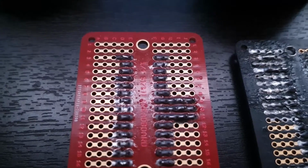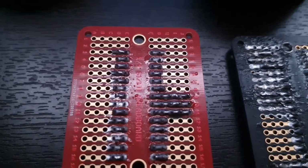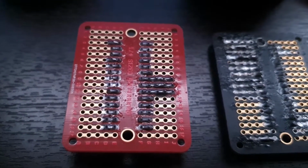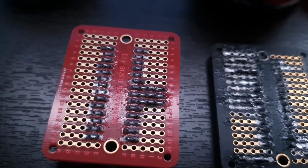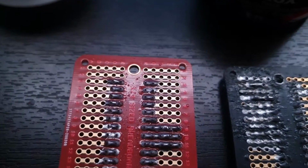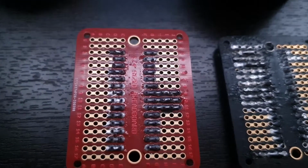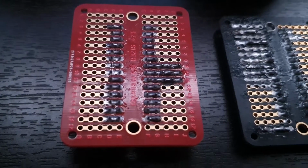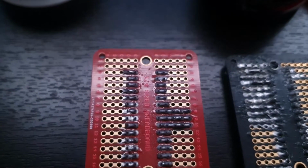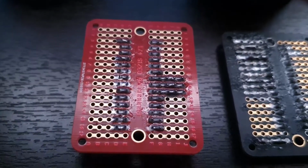And I just take like a screwdriver, you could take like a paintbrush or whatever and just put it on, or you can get the nice liquid ones and you can squeeze those on. You don't need a whole lot, and it does make everything just flow where it's supposed to go, and it prevents your boards from getting melted. These are pretty high quality boards. These are made by Electro Cookie, but there's several different iterations out there on the market. Highly recommend it. Very well made.